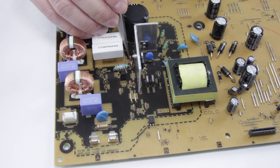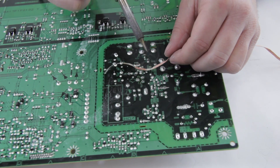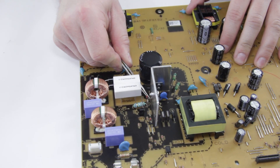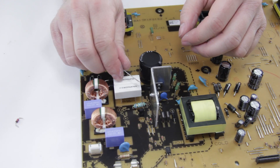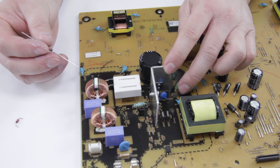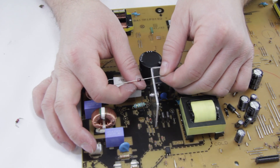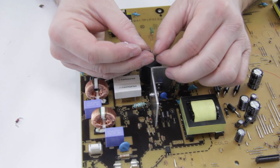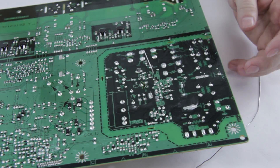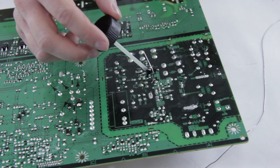D610 is found right here. It's a little bit tough to get to, but we'll flip the board over, find it on the other side, and start taking it out. You should be able to flip it out — pop it loose and out it comes. One thing to be careful of when putting this in is making sure we get it the right way around. If you look at the other ones on the board, they'll give you a hint — there's a little line at this end, and there's also a black line right on the diode, and that's the way you want to put it in. You can fold it beforehand to get it into a rough shape. Once it's in, bend the pins back just to help hold it in place so it stops falling back through. Then take some flux and paint it around the pins and the pad.